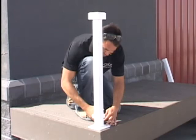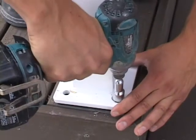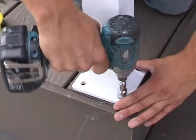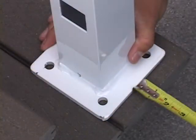For rail applications with a stair railing like our instructional deck, we suggest that you begin by installing your top stair post first. This will ensure proper alignment where the deck railing and the stair railing meet. We'll now install our top stair post as our predetermined starting point.